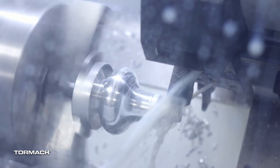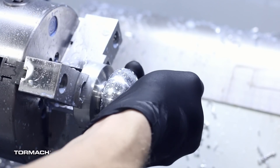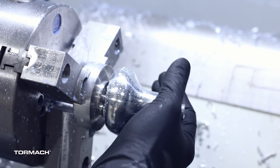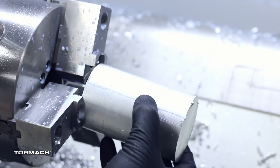All that was left now was to cut the thread and to part it off. I didn't want to drop the part off from the chuck and risk damaging it as it bounced around in the machine, so I left about a hundred and fifty thousandths of stock and then just broke the part off by hand. As you can see, this was a little bit difficult to break off, so I could have cheated the passes down a little if I wanted to make it easier, but better safe than sorry when you're just making one or two pieces.